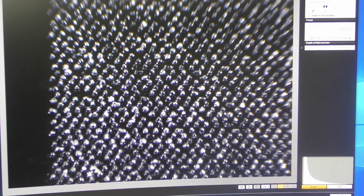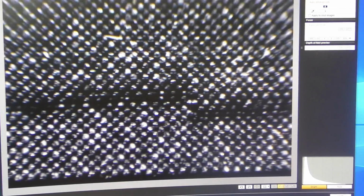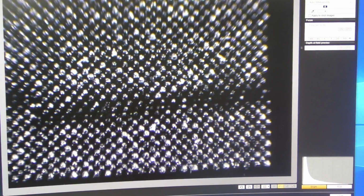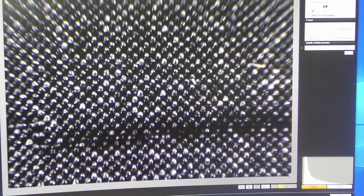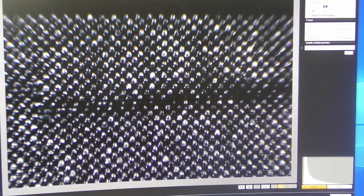Let's have a look at 10 kilohertz. Well, this is 10 kilohertz. We've got lovely dots again, and they're great as far as the checker pattern is concerned. Look, they're superb. But what's all this crap here? Look, we've got some sort of problem in the Y direction, even though I'm changing the frequency in the X direction. We're getting an aliasing pattern of some sort there, which, if I move up very slowly, all of a sudden, we've got a repeat of it.